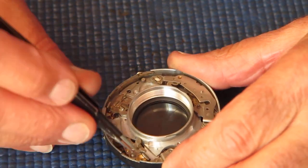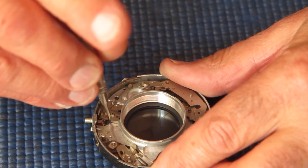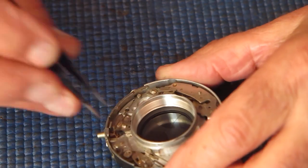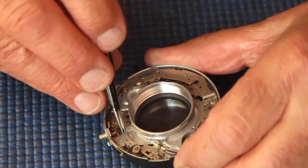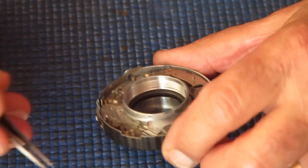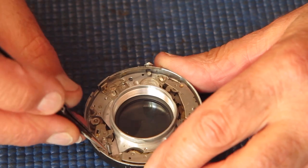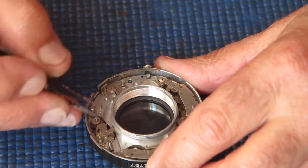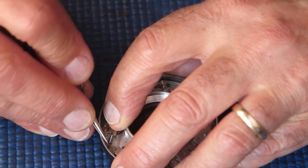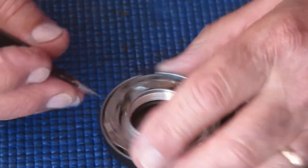These standoffs that the thing stands on, both of them are loose. That's a funny triangular shaped piece at that end. I'll remove the flash contact. Single screw in this case, holding the contact to the mechanism plate. Here we have the sector gear and the pallet wheel. I'll unhook that from its post if I can.